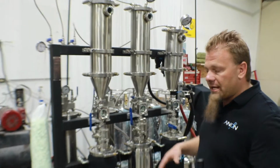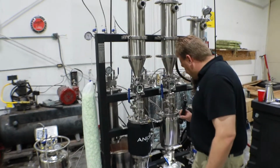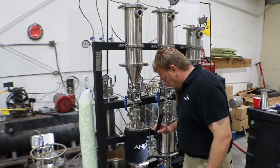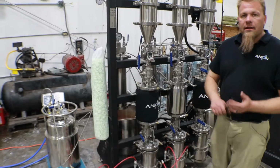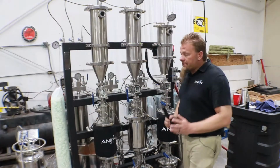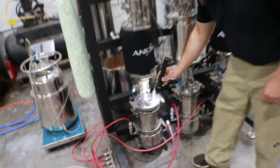Pressure-wise, they're actually starting to level out, and they're balancing out with each other, so they're pretty close. I think the Welch pump is still going to definitely finish a little bit ahead, but it's not going to be very much ahead. So we'll go ahead and keep recovering and see what we end up with. All right, so right now we're almost about 9 pounds in there. So we'll take a look and see where we're at real quick.